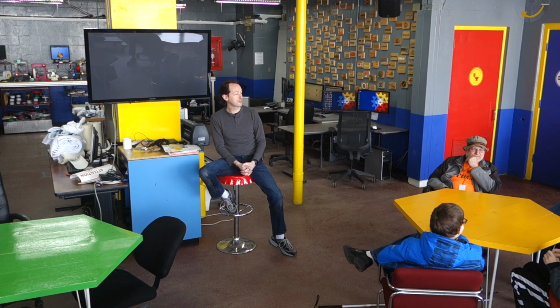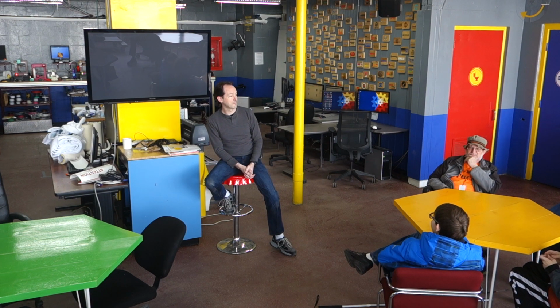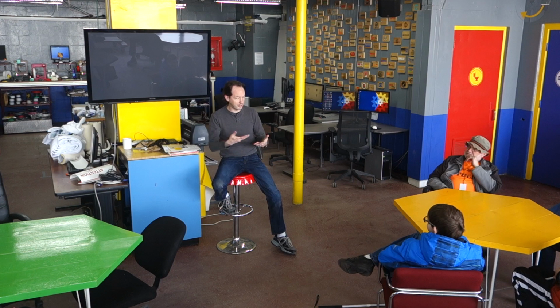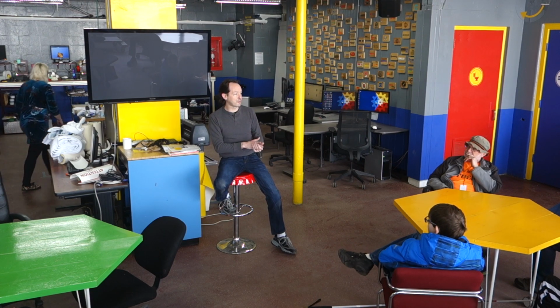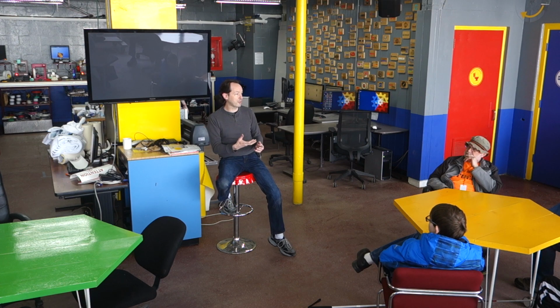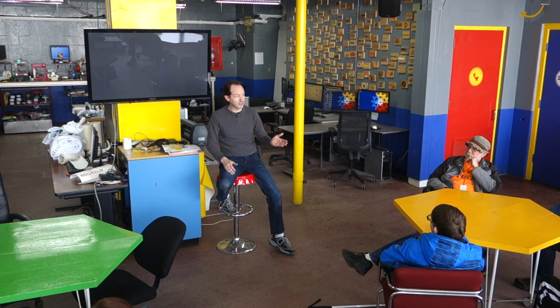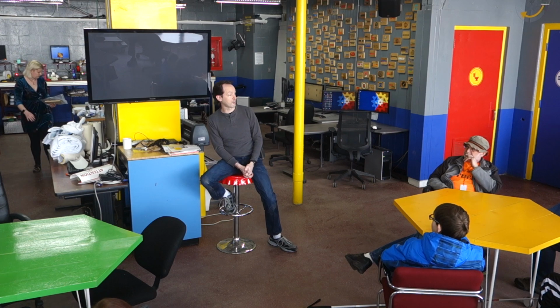Okay, how'd you make that big, loud noise and flash with just a vent? Sublimation. We put a lot of electricity into a piece of aluminum. The aluminum got very hot as a result. We put so much energy into the aluminum so fast that it got so hot it didn't have time to melt. It went directly from a solid to a gas. It's called sublimation.